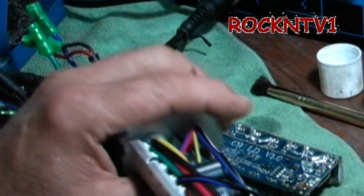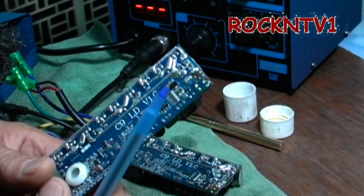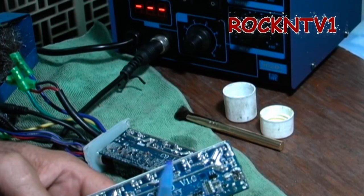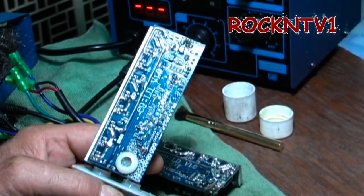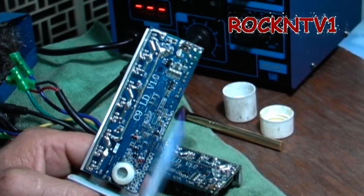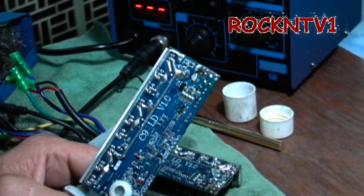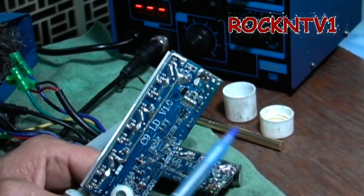The shunt acts as a measuring device — the measurement is built into the thickness and length of the wire and how many shunt wires are on your board. A problem with these controllers is that while most SMD devices are machine-placed, the FETs and a lot of the soldering on the back side of the board is done by hand. The solder traces are near their limit of current-carrying capability from the copper built into the board, and the smaller they get, the more problematic that becomes.